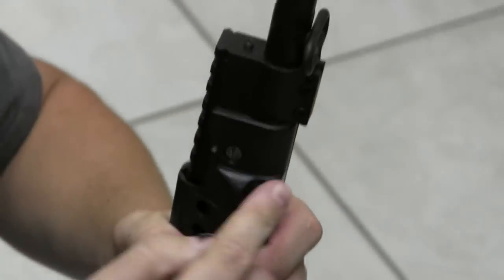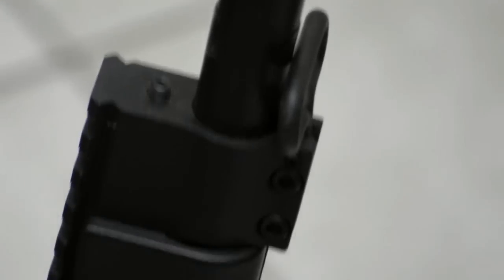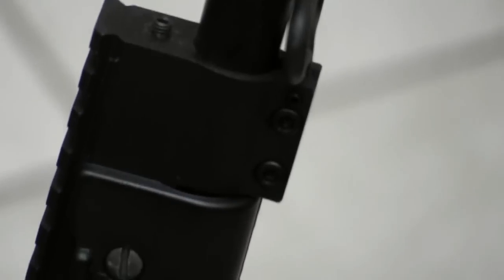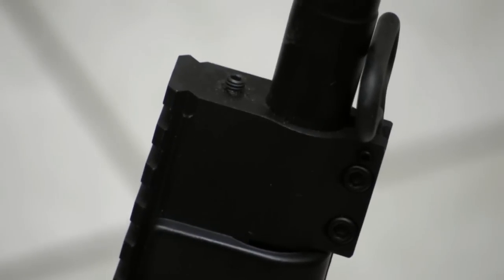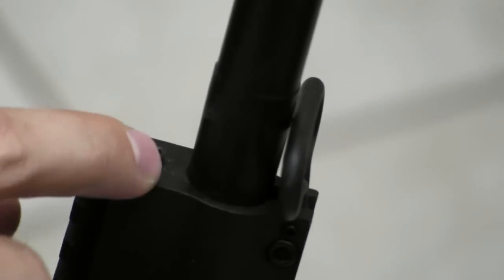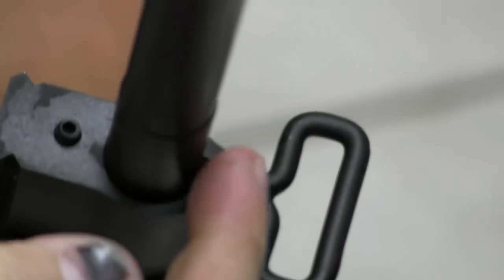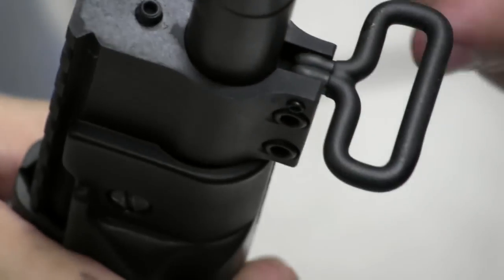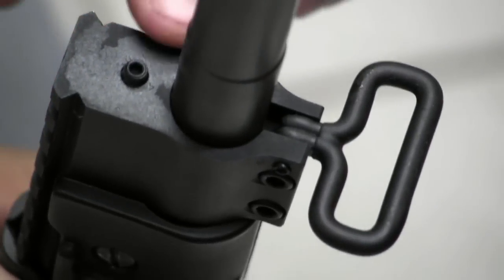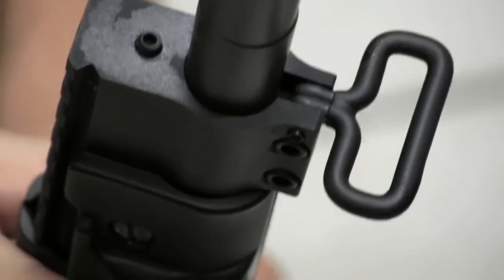To locate the gas block, typically one would use a cross pin drilled through the barrel. Okay, can you see that? Instead, here we have two set screws that are simply putting tension on the gas block. It's solid up here, and it's cut down here, and they just slide it over and then clamp it down with tension. So there's nothing actually positively holding this in place.